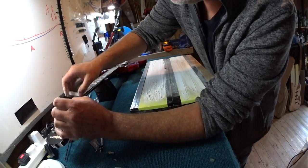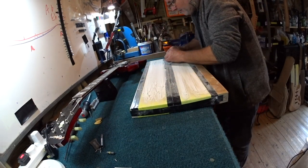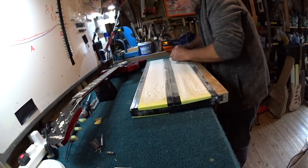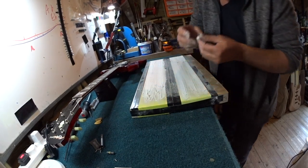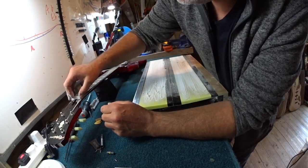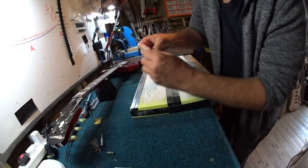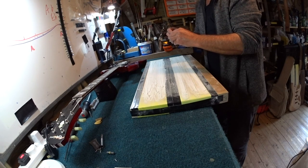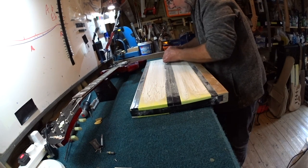So that's really snug, and I'm just going to now take the front edge, alter just the angle a tiny fraction, which will effectively thin the base down a tiny bit more. So now I expect this to just drop perfectly into place. Again, still almost perfectly into place. Again, I'm just looking for the right angles that need to be just right, which they are, and a little bit more on the back edge now.